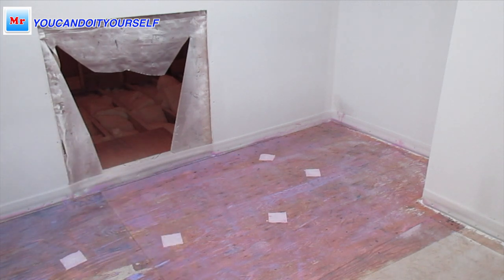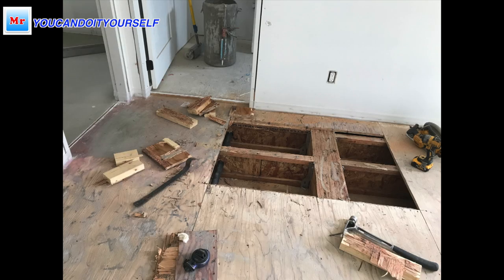So why do I level only walk-in closet? Because I have to level in this area, but on this side where I showed there were squeaks. We cut a little bit, and then the squeaks did not disappear, so we cut a bigger spot, and there the joist was only with nails. Nails make sound, and then we put screws and put plywood back. It helps.